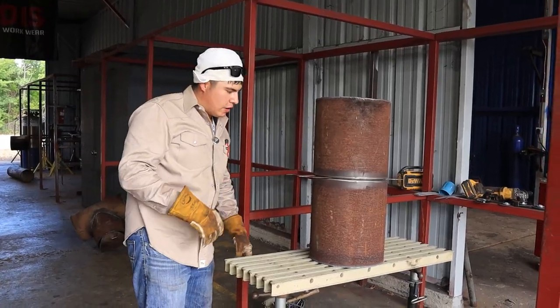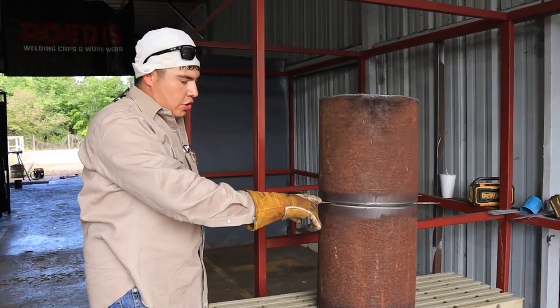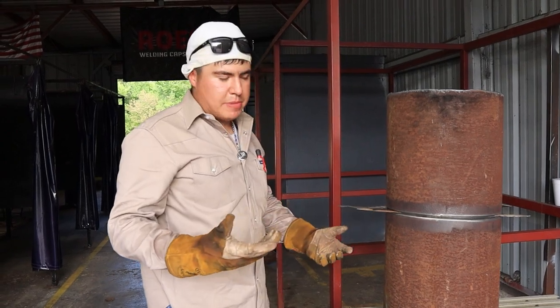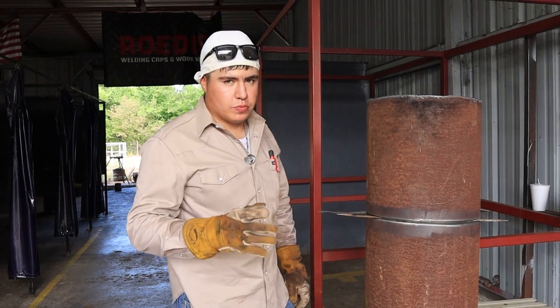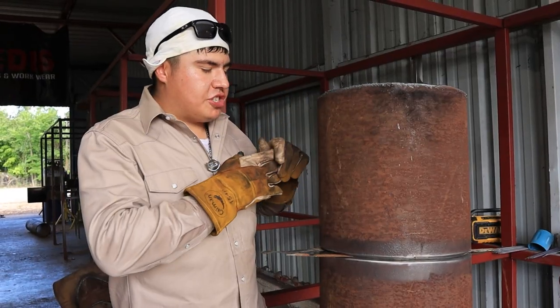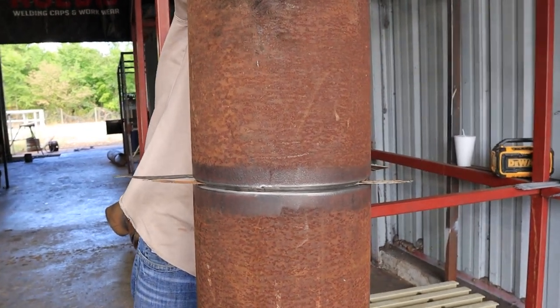All right guys, right now I've got these 16th spacers right here. You could use a saw blade or anything that's a 16th. Right now I tacked up two saw blades, basically, that way I have enough room for my 12-inch. What's really important right now is to line up your seams, because like I said earlier, that's going to be the weakest part of your pipe. And always check your high-low on all four corners, and make sure your pipe is lined up.